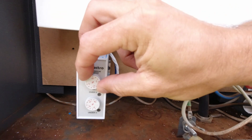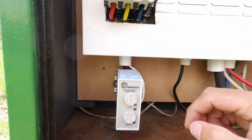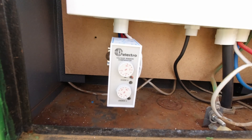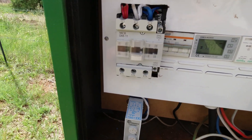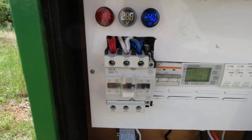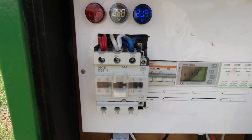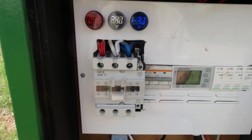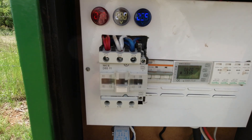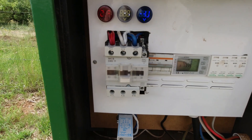Now we're going to set it back. And there we go - pulled in. And the same with the under voltage. I'm not going to do it many times because I don't like the electricity going on and off constantly. Your under voltage will get your fridges and stuff to burn the compressors, so ideally that's not what you want. The whole setup, which I bought from a renewable electrical supplier, was in the region of about two and a half thousand rand.